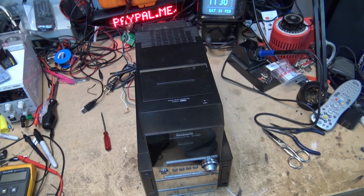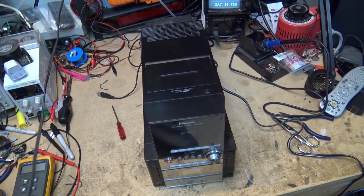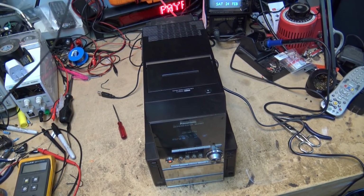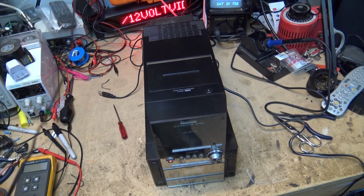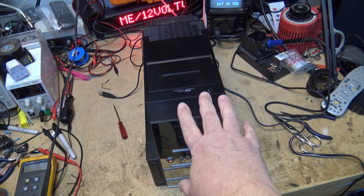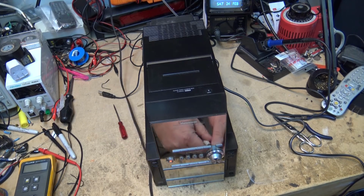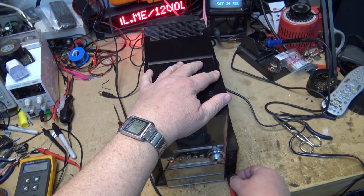To cancel the demo mode, you have to either set the clock using the remote control or press and hold the stop key on the front that says demo. With it in the standby mode, press and hold the stop key until it says demo off, and that will cancel that cycling display. I'm just going to connect this to my existing system using the headphone output because I don't have the bi-amp speakers with this, and it's not a problem with the amplifier.